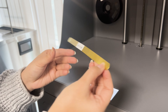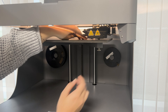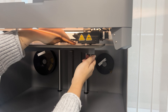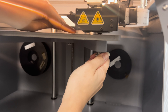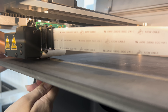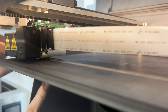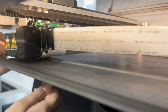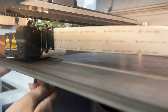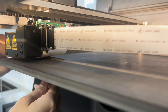Take the plastic shim and slide it under the plastic nozzle on your printhead. Raise your print bed until you feel a slight resistance when sliding the shim. When making adjustments, you may sometimes find that you have issues getting enough travel from your thumbscrews. If this is the case, please run the adjust the offset utility before proceeding with the shim bed leveling utility. You can find a video on that on our channel.